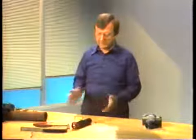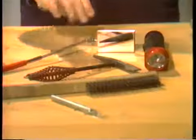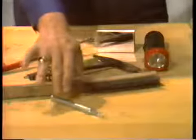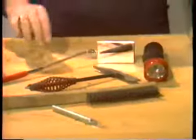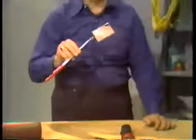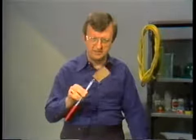When you begin the inspection process, there are several tools that you should have with you: an inspection mirror, a small hammer, a scribe tool or knife, a wire brush, and a flashlight. An inspection mirror will be useful when you look at the water wall through the inspection doors. Use it when inspecting places in the water wall that are not easily accessible.